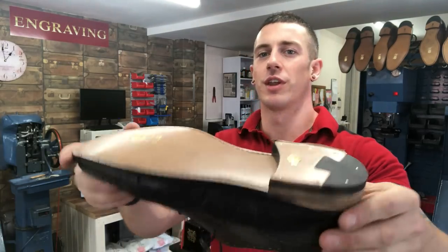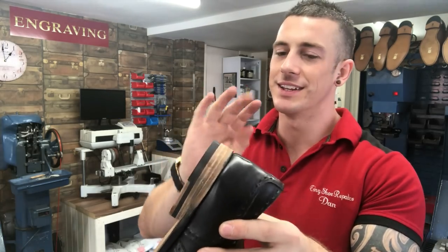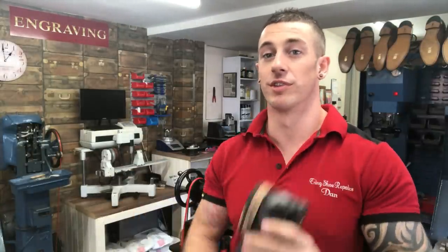We're nearly there - the physical side of the job is done but there are some cosmetic things to finish. The heel is still rough and needs inking and waxing. I'm going to put it on what's called the smooth band - very fine sandpaper to give it a dead smooth finish - then do the waxing process you've seen already, and then we'll move on to the finishing touches.